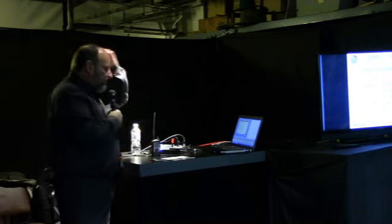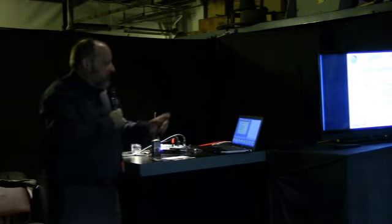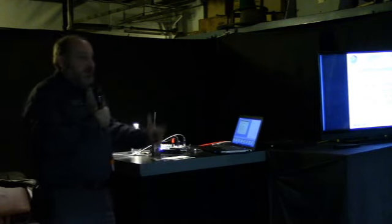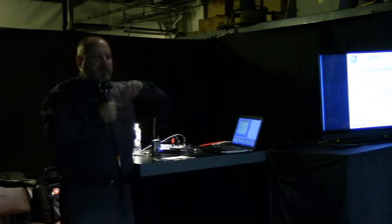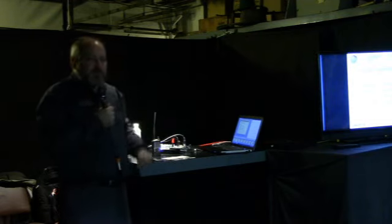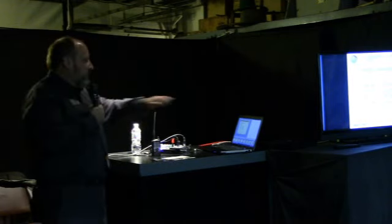So you can see here, WD5ERD, that's the call sign of the user. Repeater 1 is KE7WTBB. That's the call sign on the repeater. That's a 70 centimeter repeater because it's B. And then it's going to go out the gateway, so it's also going to be available on the gateway. And then the UR call is CQ, CQ, CQ. That just means he's going to key up, it's going to go out the repeater, it's going to get rebroadcast to everybody, and it's going to be available on the gateway. So if there's a dongle user connected to that gateway, they're going to hear it too. If that repeater is linked to another repeater, they're going to hear it too.